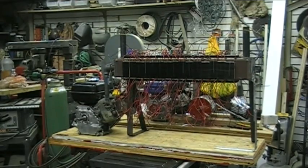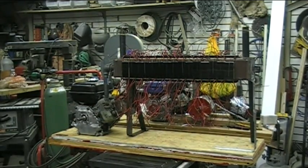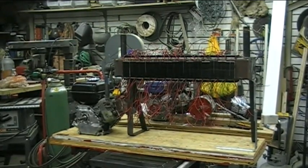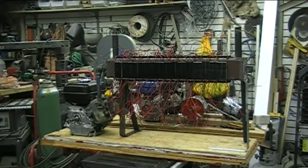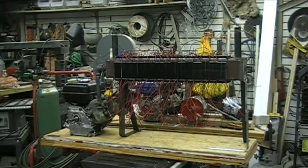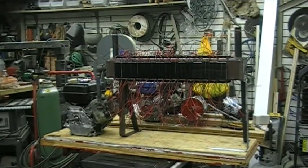So we're going to start working on the carburetor, not carburetor, but the vapor bubbling machine, and getting it ready for the heating element. The thermostats did come in though, so next video when the heating elements come in, I'll show you the thermostat I got. It's really neat. They're only about $7 or $8 apiece, and they'll control the temperature to 1 degree. In other words, if we want the gasoline at 112, we can set the cutoff point at 112 and the cut on point at 111, and it will keep the gas at that temperature, I hope.